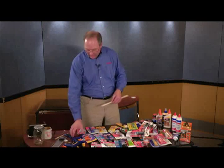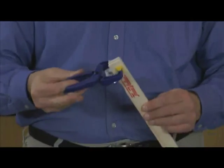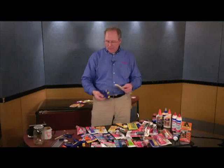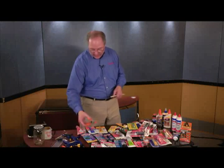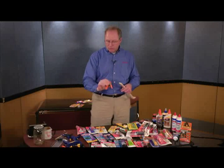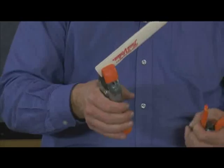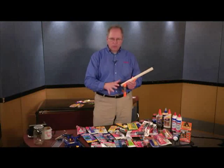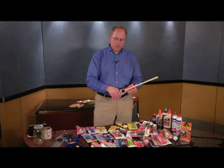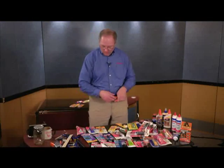If you're gluing two larger pieces together, the ratchet spring-type clamps are a lot quicker. They're just sitting there holding it on, and that clamp won't move until you release the tab to pop them back off. With these spring clamps, everything is in the pressure — they have a very large spring and there's no ratcheting. They may be a little quicker but harder to control. If you're working with a softer surface area, a spring clamp could indent the surface, where the ratchet clamp lets you control exactly how tight you tighten it down.